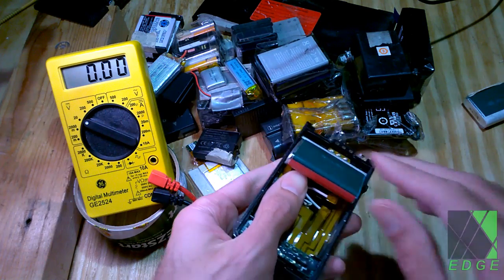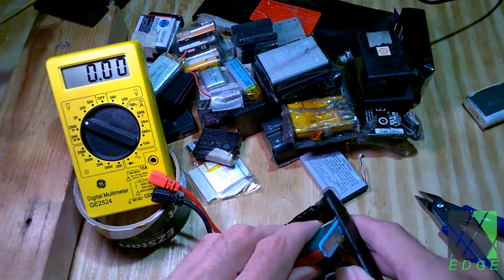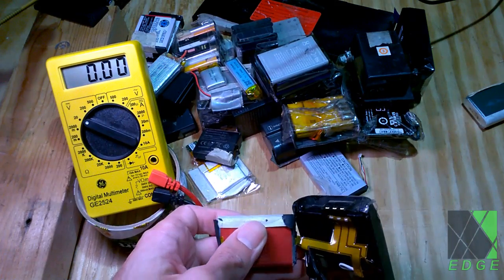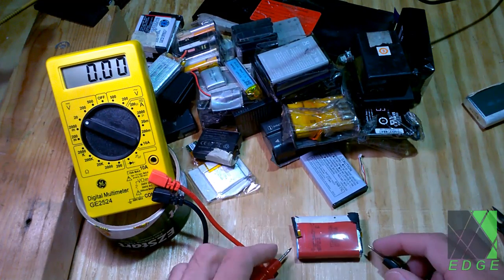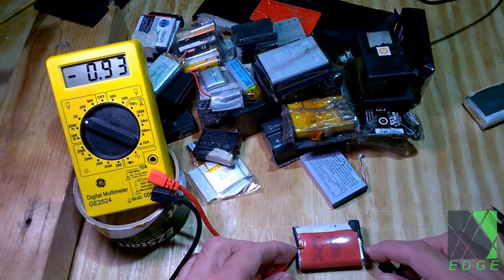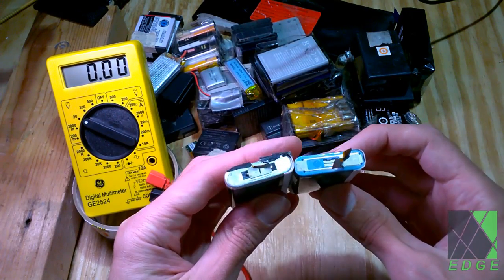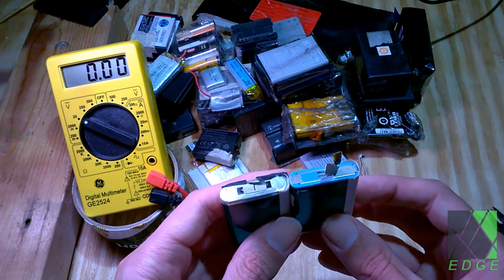These are nice fat little cells and they're not too hard to get out of the container — sometimes it's really hard, other times it's not. My job is to get these out of here as quickly as possible and away from all this circuitry, and put the cutters down so I don't short something out. I didn't pay a lot of attention to whether these were in series or parallel — I assume series, but it doesn't really matter. Let's measure the voltage: 0.93. Both cells were pretty much deep discharged to a similar level, but I don't think it's hopeless.